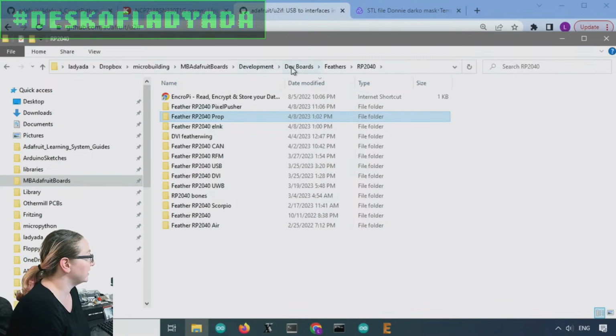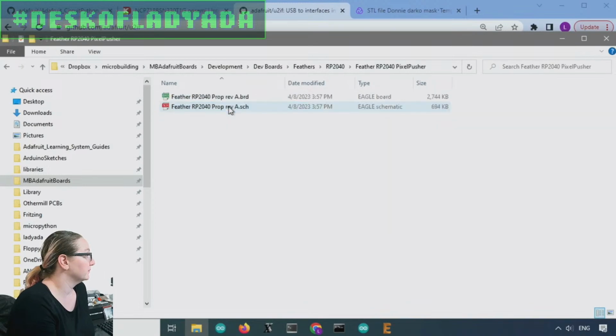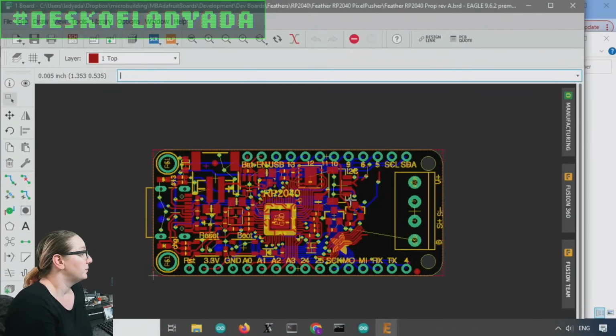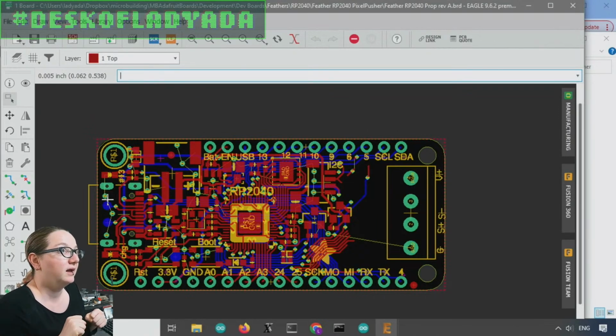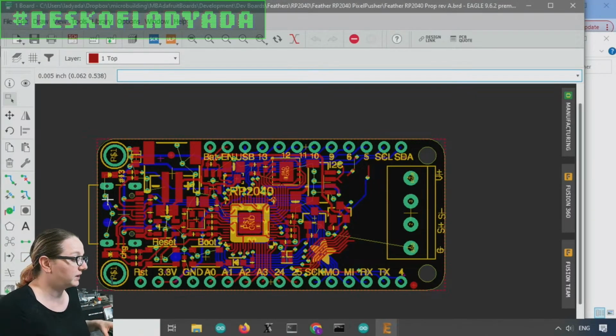The last thing is that I wanted to make something like the Scorpio, but instead of 8 pins, maybe it would drive 1 or 2 NeoPixel outputs. The idea is that it would have screw terminals, you can have NeoPixel out, and you can get 5 volts, 3 amps from USB-C. But it is possible to get 5 amps, and 5 amps would be a massive number of pixels. Then you could plug this into a really big USB-C power bank, like for a laptop, or a power adapter, and get 5 amps out.